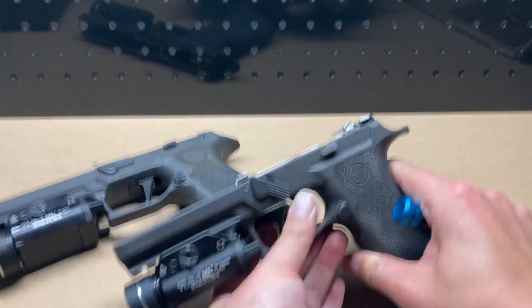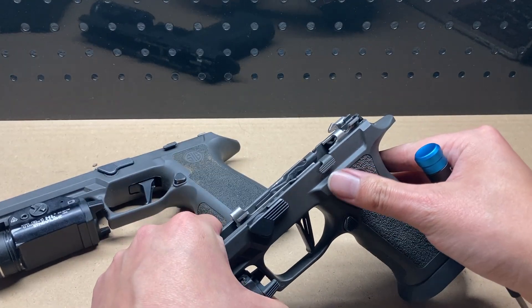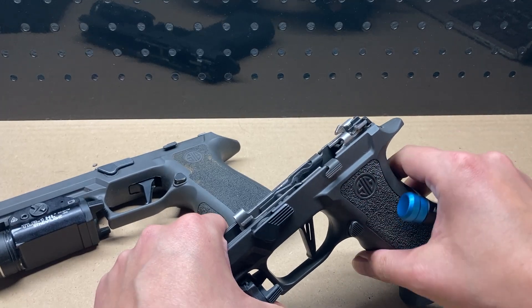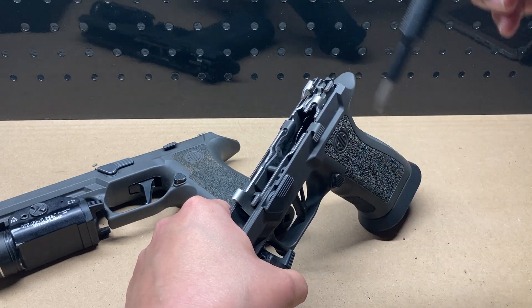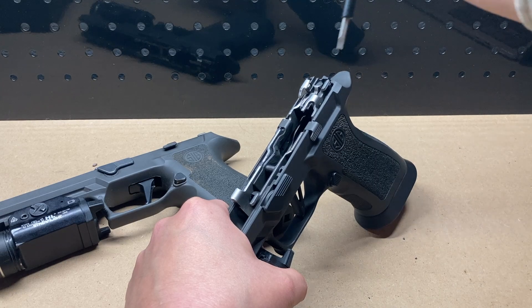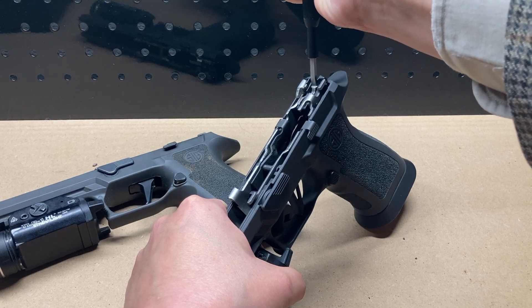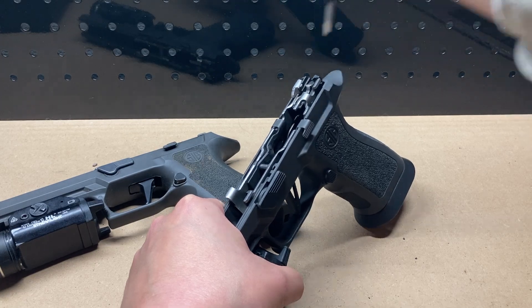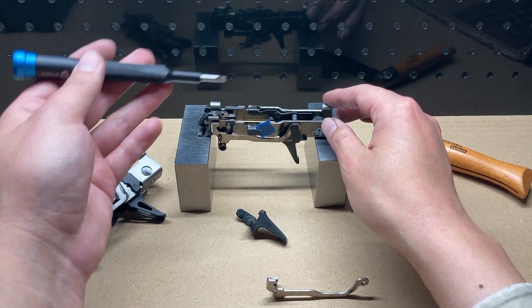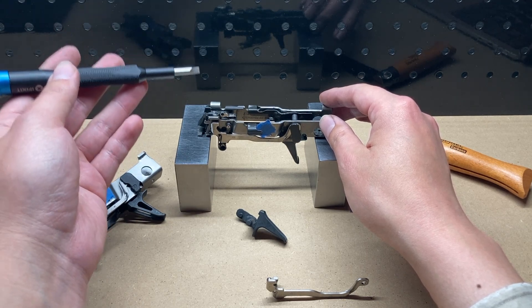This is what you don't want to see. Flip your assembly lever into the assembled position, pop the slide release, press the disconnector lever, then watch the trigger bar — on this one you should see it move forwards and back with no downward component. This disconnector-like behavior, whether intended or not, appears to be necessary for a pistol to not fail the sear movement test.